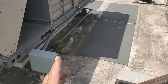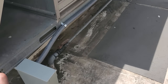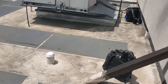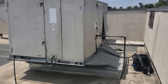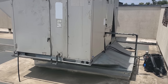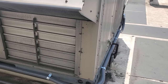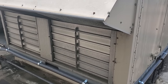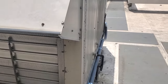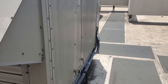We had just done a service call on this one where we had to have an electrician come out and run a new service. They had an electrical short. One of the lugs was completely melted. In talking to the manager, the manager said that this unit had gone down at the same time, but they assumed the bar and this unit were the same and didn't communicate that to us. So we had come out to work on the bar AC, found an electrical problem, took a couple weeks, the electrician redid his stuff, then we came out earlier this week and troubleshot the unit.